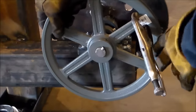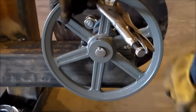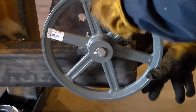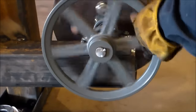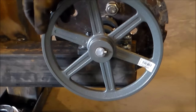What I did on this — I'm going to call it the crankshaft pulley — I machined a keyway and put a key in there. That way I can lock my pulley.